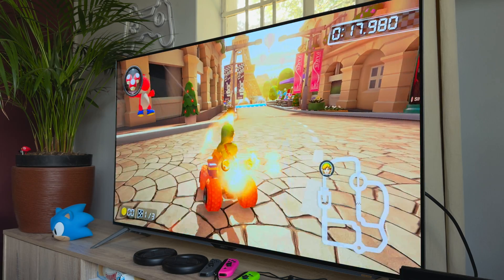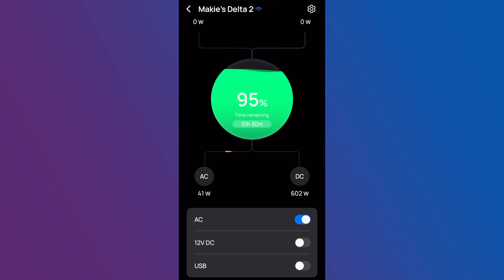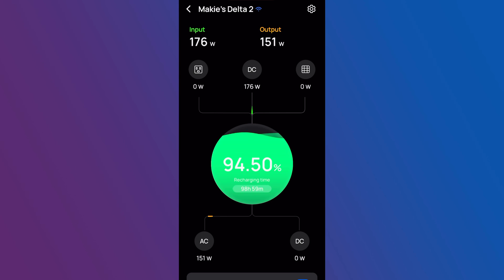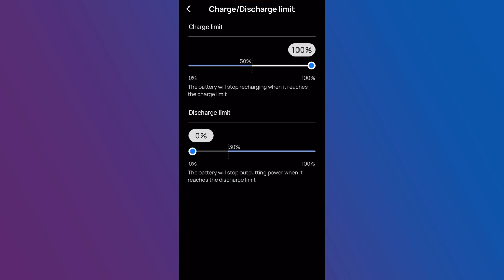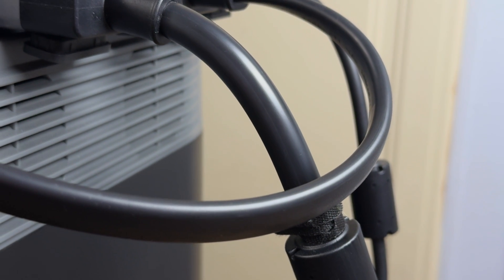I did test this — I left the TV plugged into the Delta 2 which was fed into the PowerStream. On Prioritise Power Supply mode, the solar power and Delta battery fed the PowerStream's AC output to 800 watts, or the max you set in the app, and anything plugged into the Delta 2's AC port was also drawn from the battery. The battery wasn't being charged by the solar input at all. On Prioritise Power Storage mode, the solar input went to charge the Delta 2 battery, and devices plugged into the Delta 2 drew power from the battery simultaneously. When the battery was fully charged, solar charging cut off and that power went into the home grid. You can also set charge and discharge limits so the battery stops feeding your home at say 50%, which is helpful if you have a larger Delta like the Max that might not get fully charged during the day.